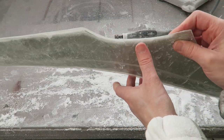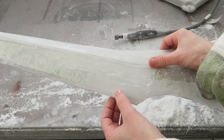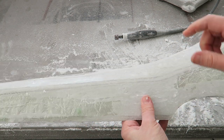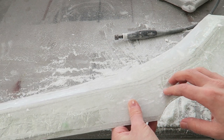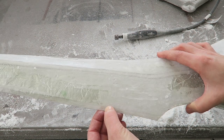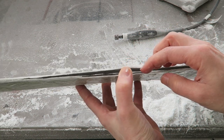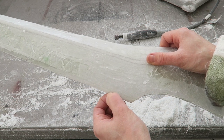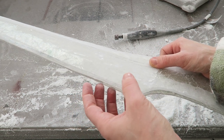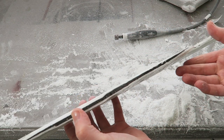I'm working on sanding this down and just running into more and more issues. My edges have popped open and it's really difficult to tell how deep I can sand — I think I've sanded it too far and it's sort of uneven. The main mistake is that the first time around when I was casting the shell, I should have just made it quite a bit thicker so I had more to work with and the piece would be more rigid. Also, I'm thinking that the foil on the inside was a bad idea, because if I close this too much, it closes off the light — which is one of the problems I had when sticking it together. I realized it was completely closed in some areas, no light was getting through, so I had to go in and reopen it, and that just made the edges not stick well.